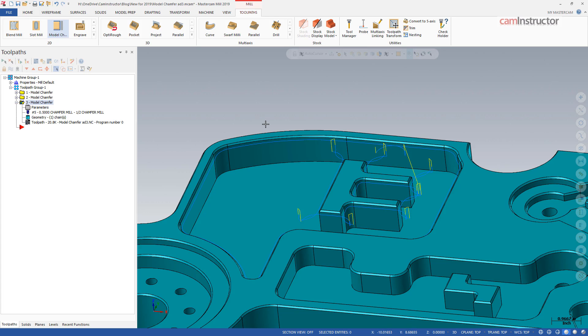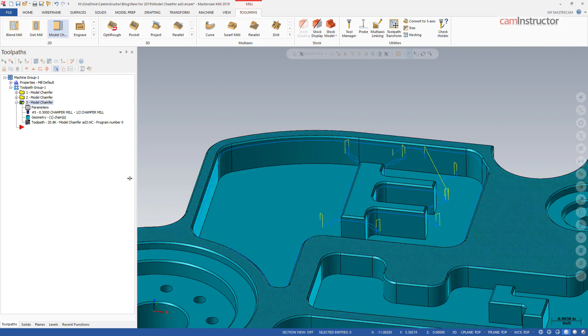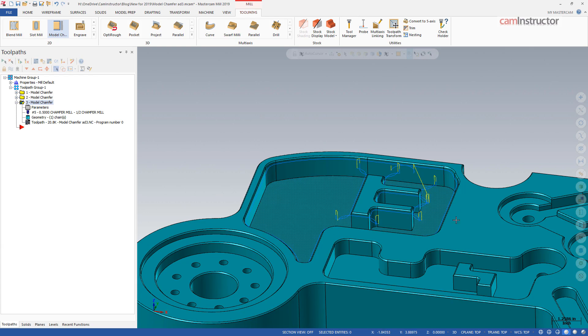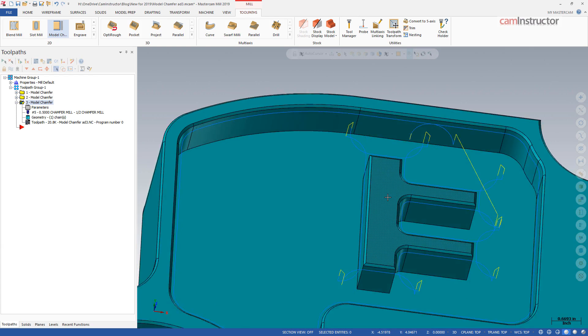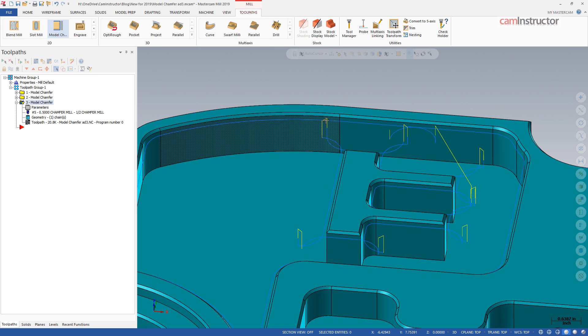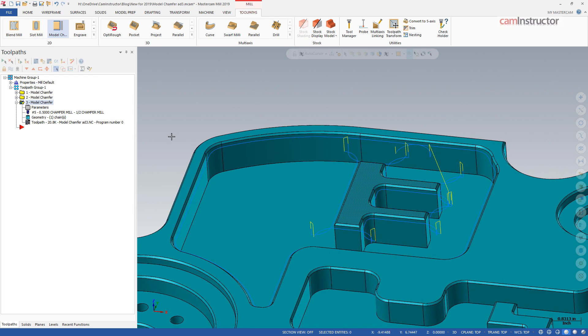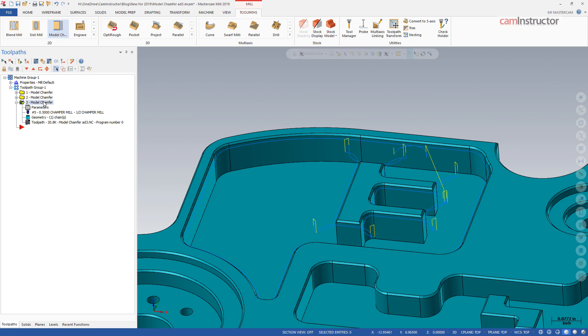You can notice a few weird things happening here. The first chamfer around the main pocket is fine, but when we get into this boss in the middle there's quite a bit of repositioning happening. If you do have a part with chamfers on it already, we'll go through why this is happening, but what I would suggest is to copy this operation and do it the opposite way.